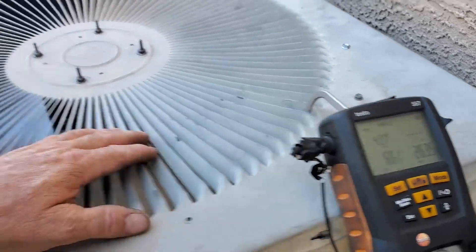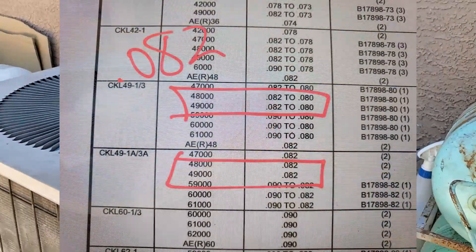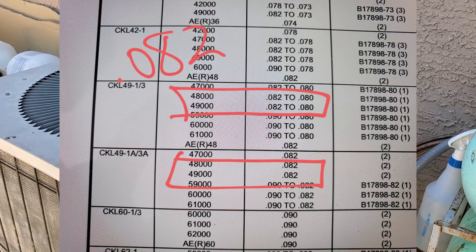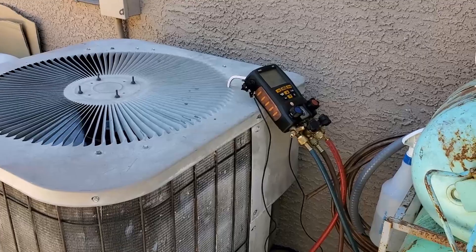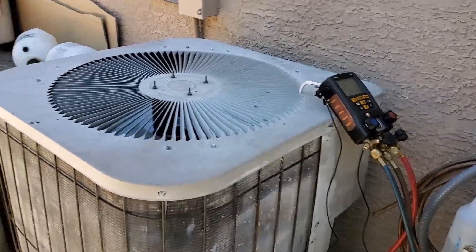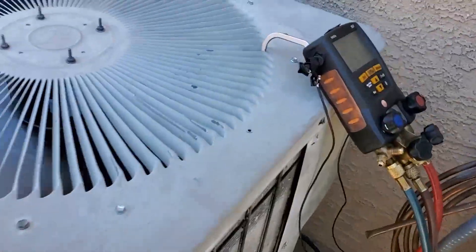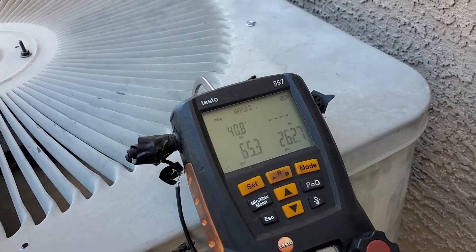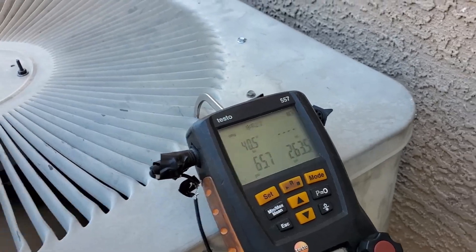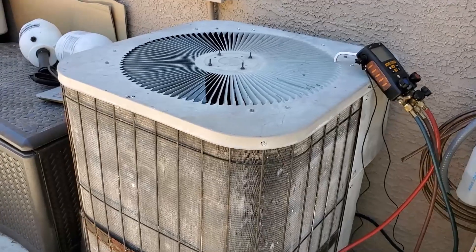Now there's an 80 piston — it said 80 to 82 or 80 to 83. It might be just on the small side at unit 80, but that'll work. That'll get me through until I change out the unit. I'm already satisfied with the pressures. It was 80 inside — downstairs has been running pretty much nonstop. Superheat's down to 41. A lot of heat coming out, so it's still getting hot. I put back all the refrigerant I pulled out, so it's charged exactly as it was with the TXV.